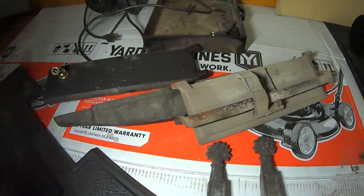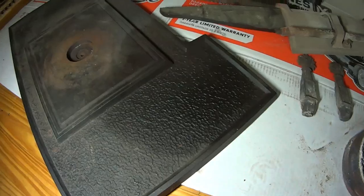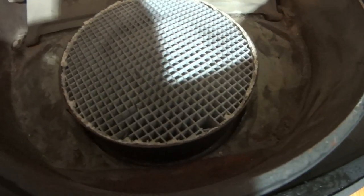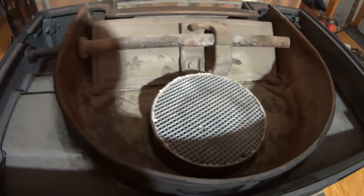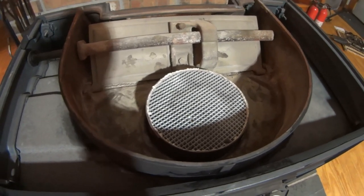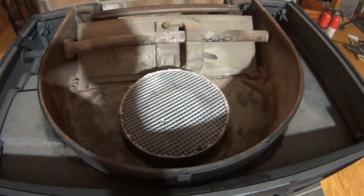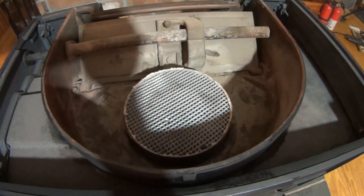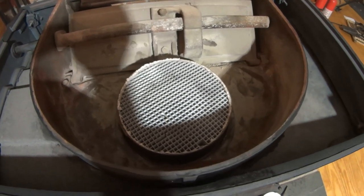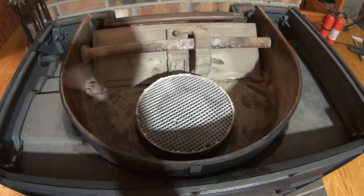Then I'm going to put the top end of the stove back together, wire brush this top, and stove black that. Catalyst is in — just blew it out. You can see there's a couple cracks, not going to worry about it. Maybe a replacement is like a hundred bucks. We're going to see if it catalyzes. If you wonder if your stove is catalyzing, in my experience you start the stove, switch it over to the catalyst, and you should be able to go out and look up at your chimney and really see nothing but heat and maybe a really light trace of smoke. If you see a ton of smoke, you're still likely burning pretty much by conventional means. And if it gets plugged up and doesn't burn clean quickly, you're probably not catalyzing correctly — so replace the catalyst.